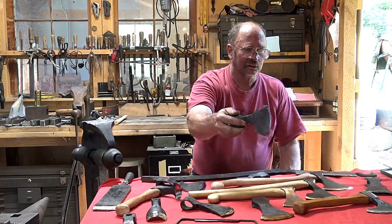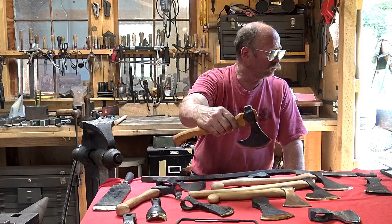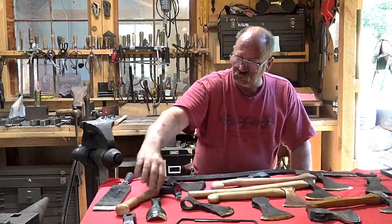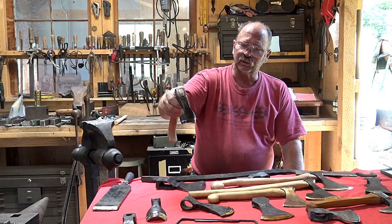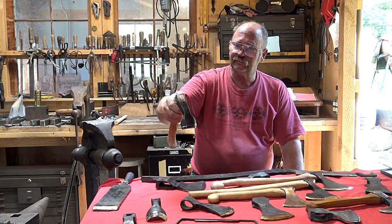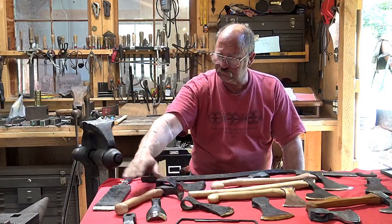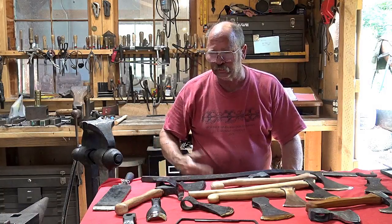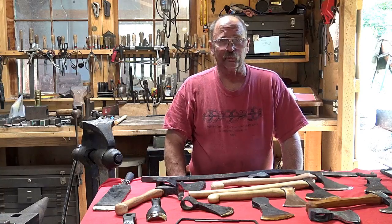You know, an axe like this, or this axe is a solid one-piece tool steel axe. It's all a piece of O1 tool steel. And this adze is all O1 tool steel. After looking at what I brought out to show you, I think these are the only tools that are done out of single piece tool steel. I think everything else here has a forge, well no, the big slick chisel is single piece, although the socket is forge welded. So there's still forge welding involved. Sorry if I'm rambling.